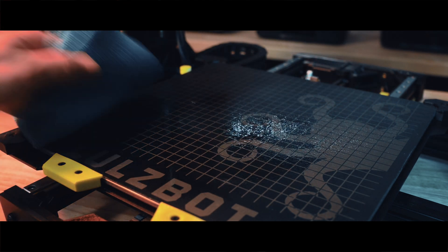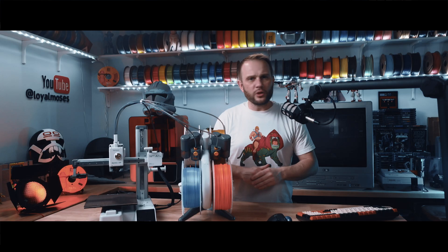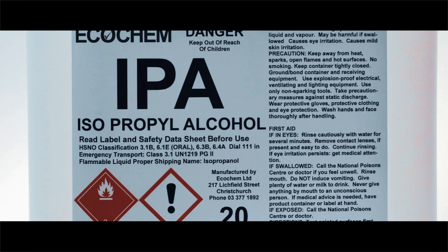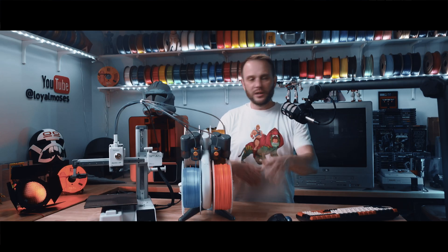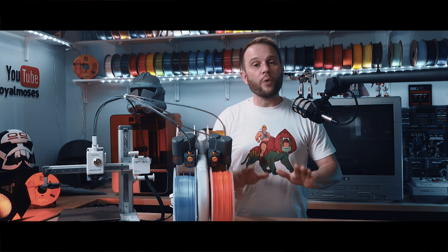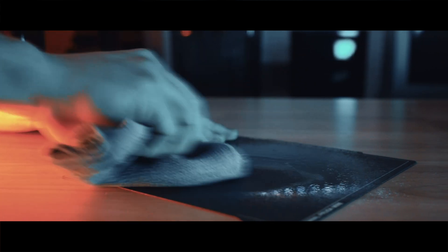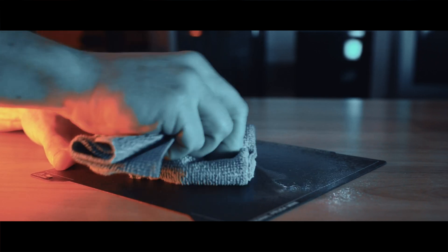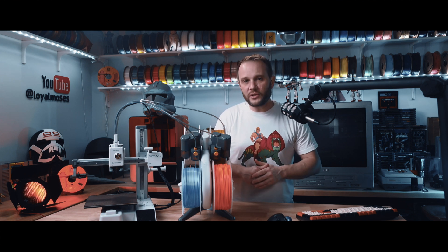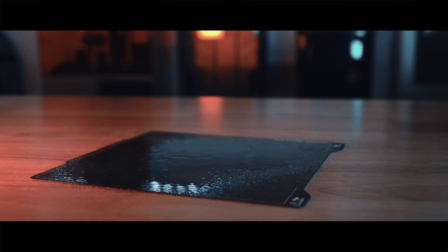Keeping that surface clean and properly textured is where things can go wrong. The most common way to clean PEI sheets is with isopropyl alcohol, or IPA. That's what I use most of the time, but there's more to it than just wiping it down. IPA is a solvent — it breaks down oils, grease, and residue left behind by your hands, adhesives, or any lubricants on a 3D printer. It evaporates quickly, which makes it perfect for cleaning your build plate before a print. But if you overuse IPA, it can actually start to degrade the surface of your PEI sheet. Repeatedly wiping your plate with IPA, especially at high concentrations like 91% or 99%, can slowly smooth out those tiny peaks and valleys, because IPA doesn't just clean — it also dissolves surface-level contaminants, including tiny fragments of PEI. So IPA is effective, but too much of it can reduce the adhesion that your PEI is known for.